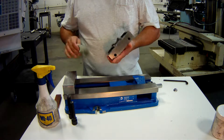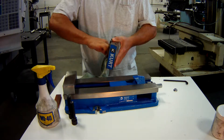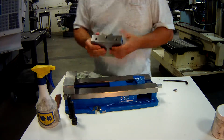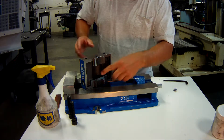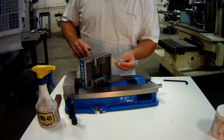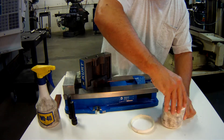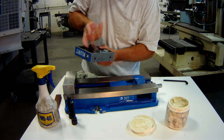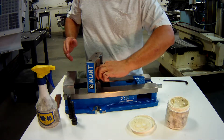Now we're going to put this back together. I reached in and inspected it with my finger — it was dirty — so I cleaned that up with a rag. I'm going to clean up the mating area where the angle lock goes. In that mating area there's a pocket in which a half-spherical bearing rides. I'm going to put that bearing in there with a little bit of grease, put it in the pocket, and then the spherical face goes down into the pocket.